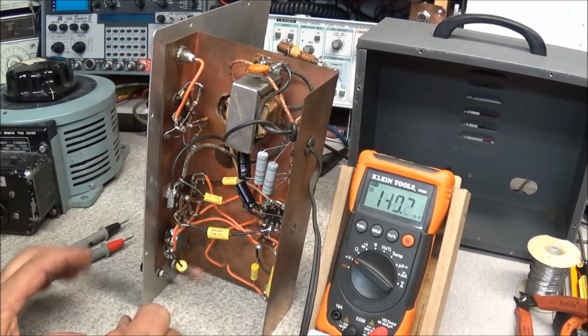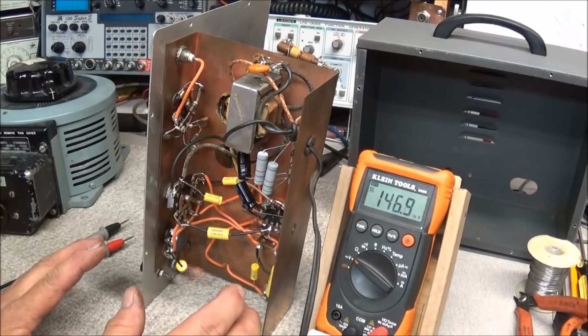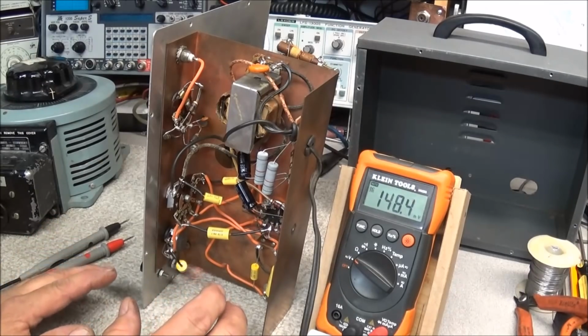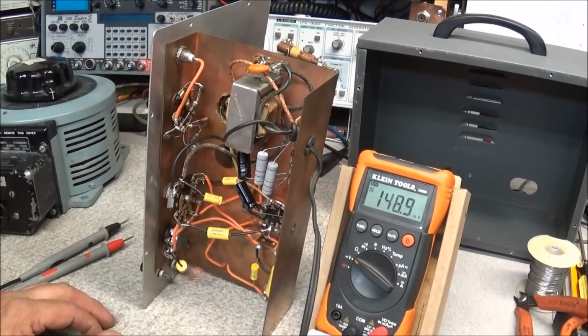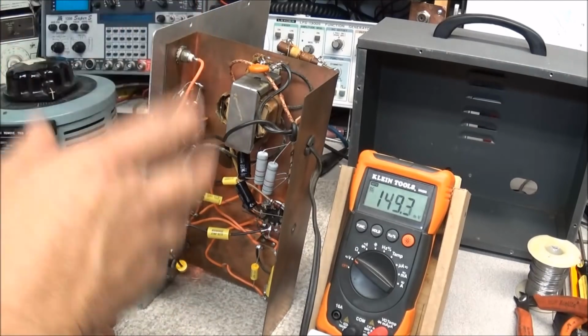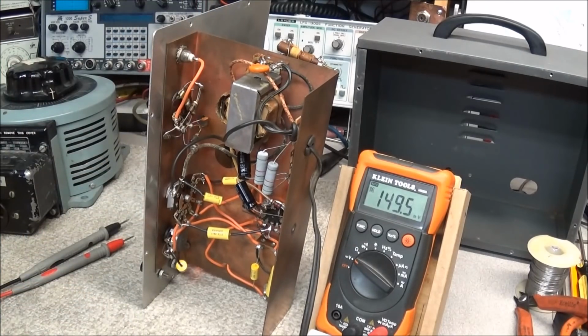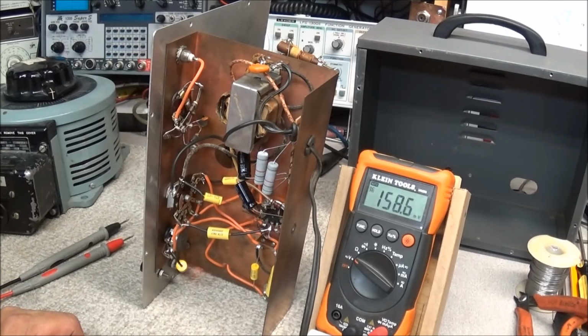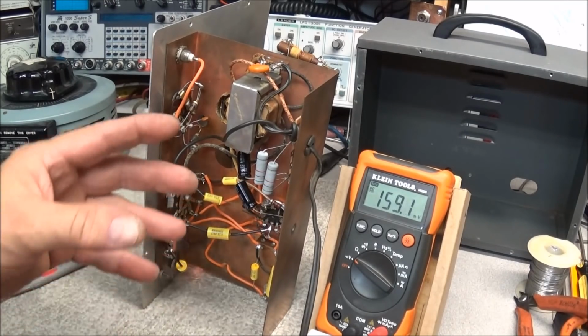Now take in mind that our voltage today is over 120 volts, so it's going to bring everything up. Now, you could go in and tear the transformer apart and add a turn, remove a turn, or whatever until you get the output of the transformer where you need to be. But we'll use these resistors for now. Then I'll go back and probably put a metalized flange resistor to the back of the case just to absorb any heat.